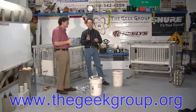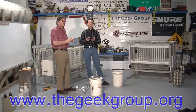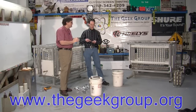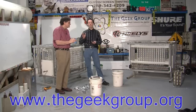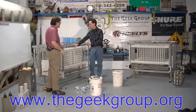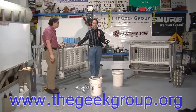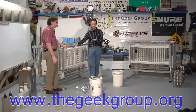So these will take really high amperages, and that's a big thing. Part of what makes it pulse rated is that it's designed from the get-go to be able to handle the big pulse of energy. When this fires, in continuous duty it might only see an amp or two. But on very short timelines at the pulse, it can be hundreds or even thousands of amps. So this, for continuous duty, might only be rated for 20 amps, if that. But the pulses coming off of here for very short time frames could be 10,000 amps, easy. And it'll take that all day long. So that's what makes them different.